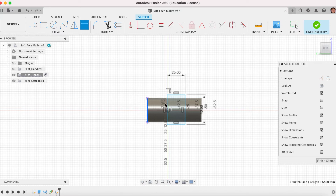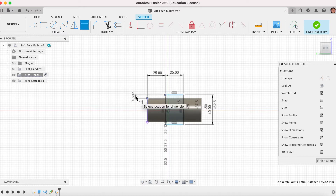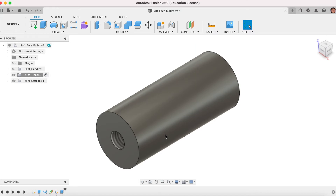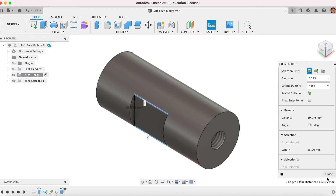Zoom in on that face. Create a Sketch and click the plane we just created. R for Rectangle — drag a rectangle over here, make it 40. The critical thing is that the plane must extend past the round cylinder. We need to put a dimension on here. The model was 75mm long, so take away 25 is 50, and half of 50 is 25. Click there and type in 25. We also need a dimension from that point to that point. 40 take away 32 is 8, so half of that would be 4. Now that sketch is fully defined. Extrude, cut it, and go negative 3.5. Inspect — that line to that line is 90.975. That's good enough.